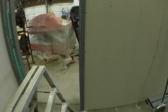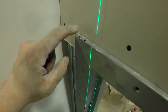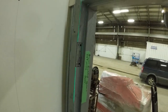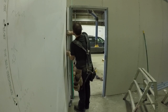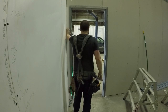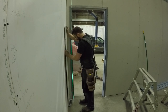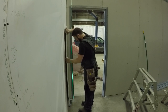I'm measuring tight there and then adding a half inch so it'll slip in. That little tab there gave me a really hard time — I'll link a video here to show you how long it actually took me to get this piece in. So then this is the inside leg here. It's going to be tight. You just get it snug in there so that it doesn't fall down, and just pop it with your hand. Then I go get a drywall hammer and bang it in nice and easy — it works really well. Just pop pop in and it's good.